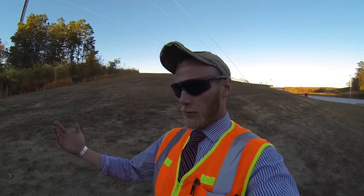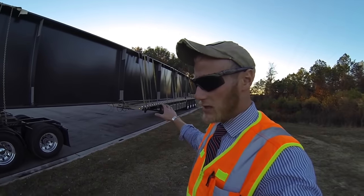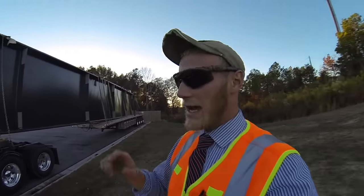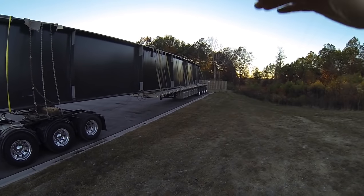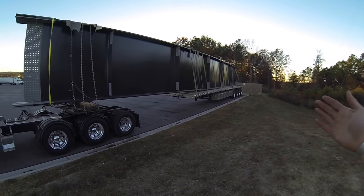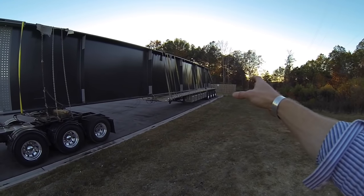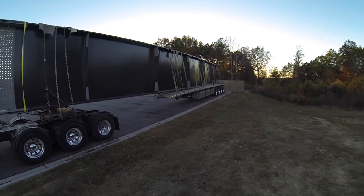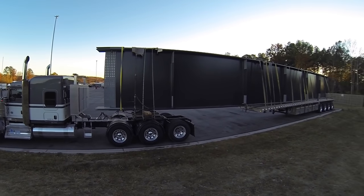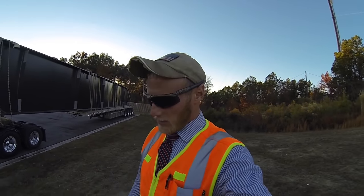A lot of people are going to ask why won't it go on a dolly to make it lower. There were actually two five-axle steerable bridge beam dollies that showed up to move a couple others of these, and they were the exact same height — the dollies don't change the height. What they do is move your wheels in a little bit further and give you the ability to steer. Right now this just works as a big extendable trailer that follows the beam. On a bridge beam dolly it would articulate so you could steer somewhat independently, which makes things a little bit easier on longer beams, but it's unnecessary on this beam. It's a 10-foot-tall piece and even on a bridge beam dolly they're sitting at the exact same measurements.